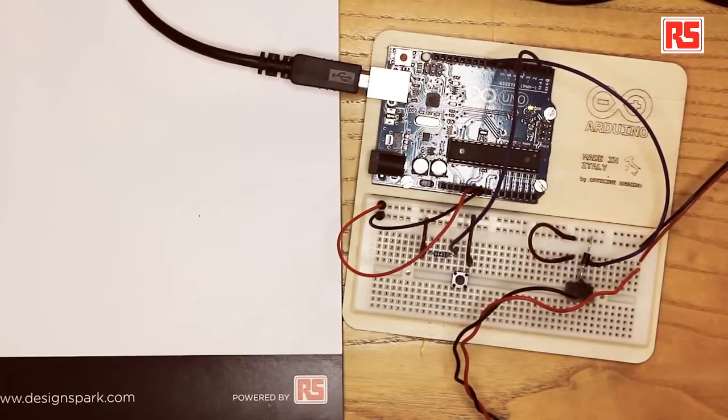So what are the issues we have to take care of? Well, first of all, the DC motor works normally at more than 5 volts, which is the standard voltage that the Arduino operates at, and requires more current than a single Arduino pin can provide. We can hook up a regular LED to an Arduino pin because the current it needs is low enough, but the DC motor requires much higher current and we risk burning the Arduino pin if we try to hook it up directly.